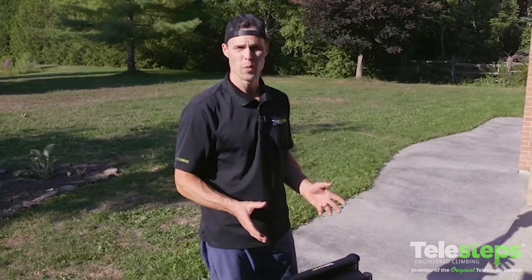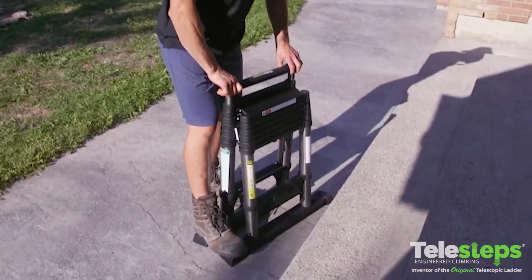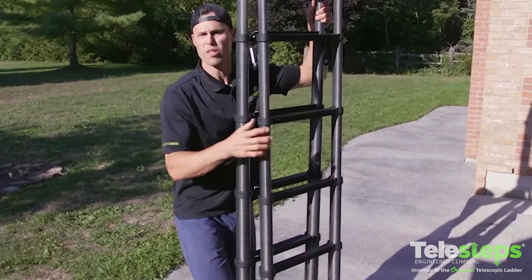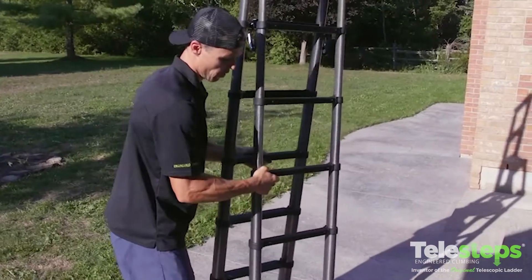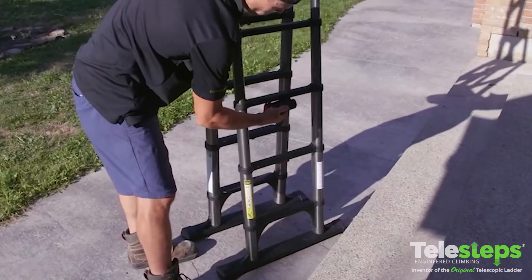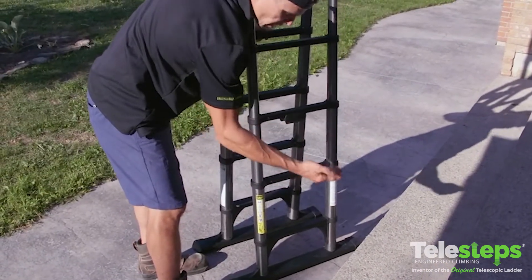Here's an option where you can use the combination ladder on a stair. Put your foot on the base again and fully extend it. With it fully engaged you can hear all the locks in place. What you're going to do now is reach to the bottom to grab the stair block. Every step you put this up to — this is one above the locks — counts as one step.